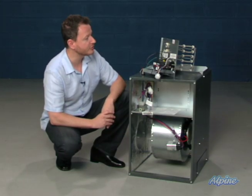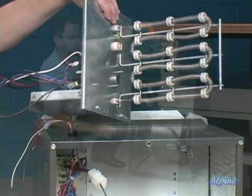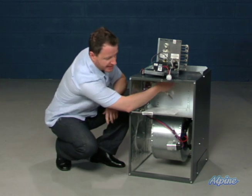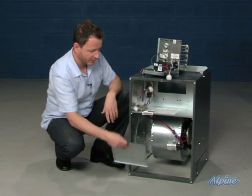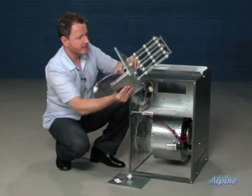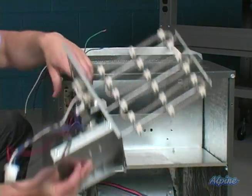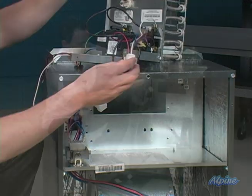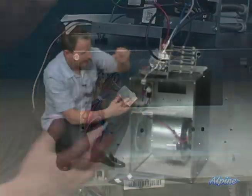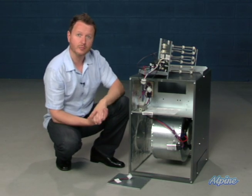If you choose to install an electric heater coil so that this will operate as an electric furnace to provide heat, it's very easy to install it. Simply remove this plate in the back here — I've taken the screws out already — remove this plug, and then the heater coil will install in that opening in the back. Once it's in place, it's screwed in, and then these two wiring harnesses are clipped to each other. It's quite simple. The high-voltage circuit is then run directly to the breaker provided with the electric heater coil.